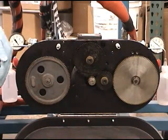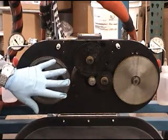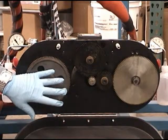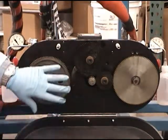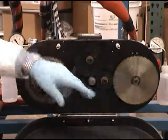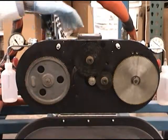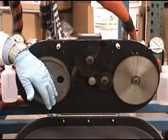And then we have a whole range that we can go through again with the gears to achieve whatever we need to achieve. If we get to the point where we've maxed out gears and pumps, and we need to do what we refer to as a reverse ratio, that is, we need 4 iso to 1 poly, what will be necessary is to take the poly pump, put it on the iso side, take the iso pump, and put it on the poly side, and now you can go through all of your gear changes.